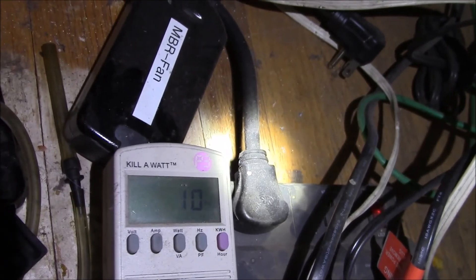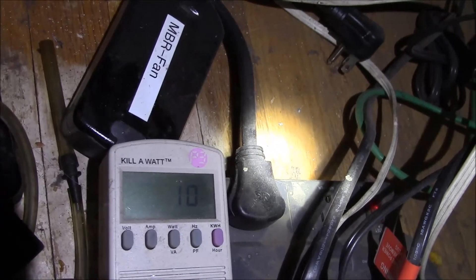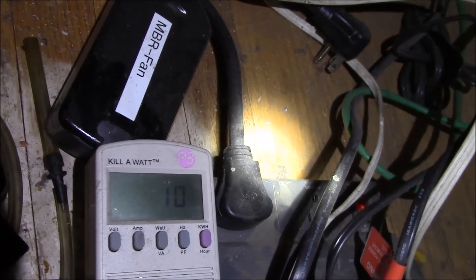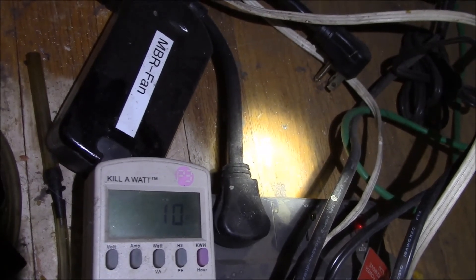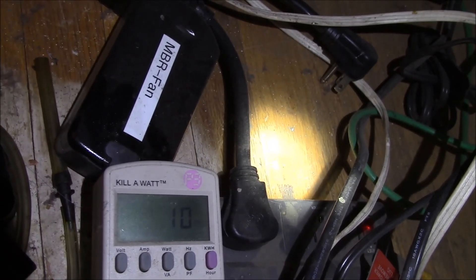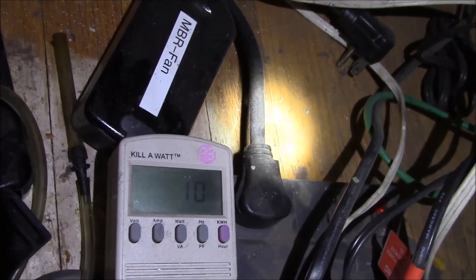The other option is to set up a small battery in my office and have that hooked to the battery bank, charging in parallel, then run the boost buck converter off that battery. That way, if I have to take the main battery bank out of service, I'd have a local battery — maybe 20 or 30 amp hour — to keep it running. Either way, 10 watts is pretty low power consumption.